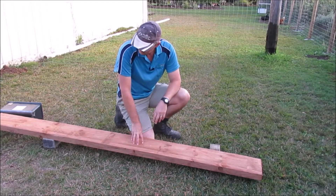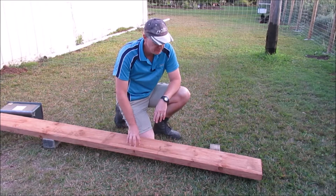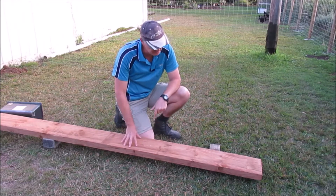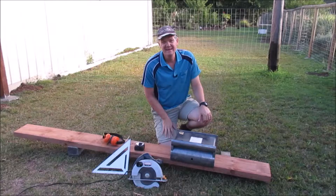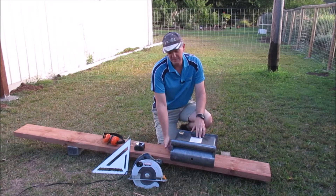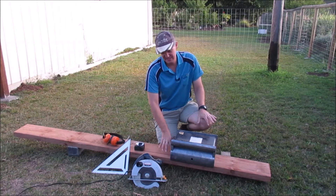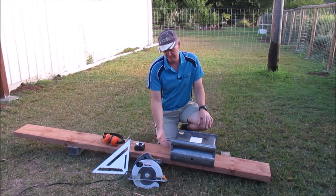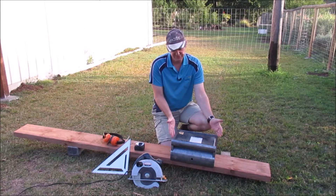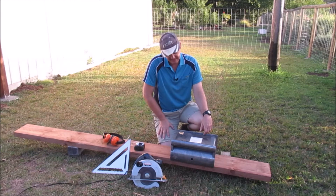This is the timber I've bought — two lengths of treated sleeper. I was actually going to get a hardwood timber but this one's colour looked really well, and I'm sure when we put some oil on it that will help bring out the colour more. We're going to have two uprights, a piece at the top, a base, and then another shelf part way down. The specifications say the bottom of the letterbox should be at least 900 millimetres off the ground, so I'll make the timber top at about 1150 mil, cutting the outside two at 45s to make it look nice and neat.